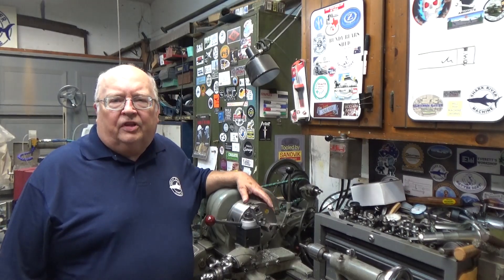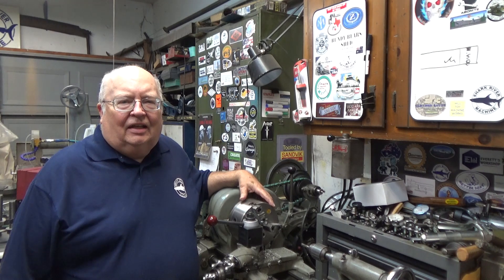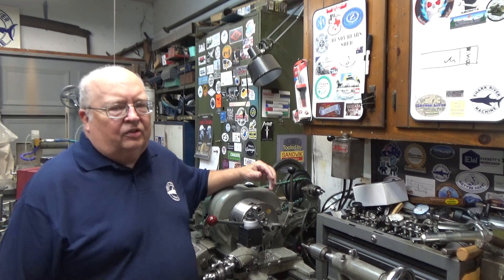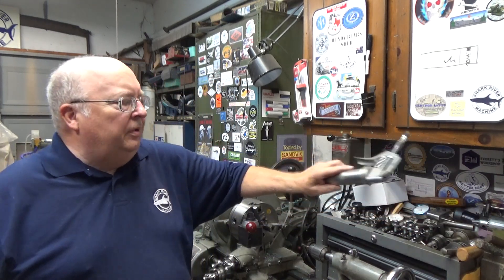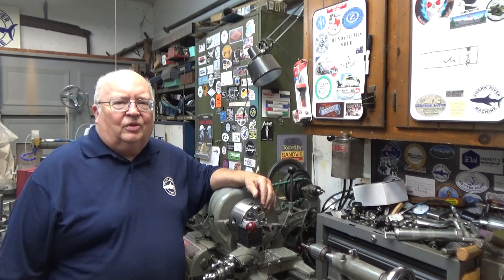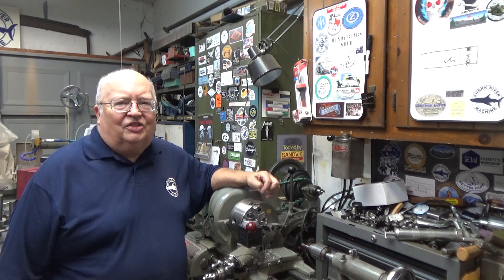I hope that was helpful. It's a simple little lathe hack — took about 10 minutes total. It took me more time to turn the camera on and off than it did to actually do the project. Now when I go to use the lathe, I just pick up my grease gun, which is laying right here behind the lathe, put a pump or two in there, and my intermediate shaft will stay greased. Hope this was helpful — I'll see you in the next video.